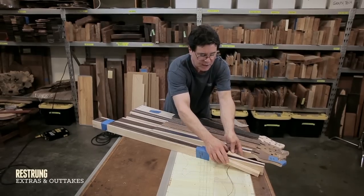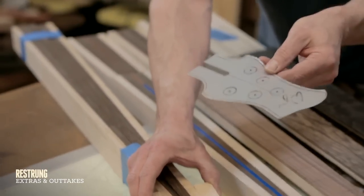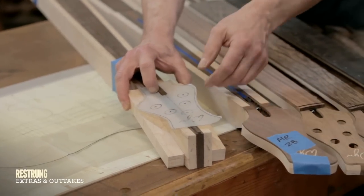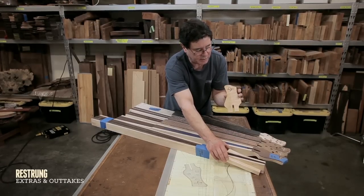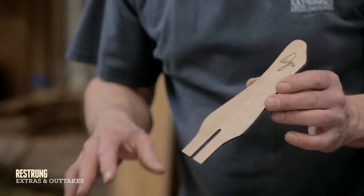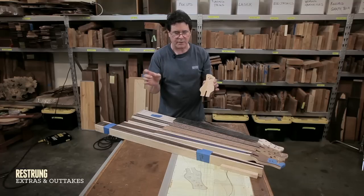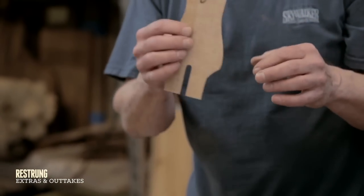I put these wings at an angle because the headstock goes down at an angle. I have a template — this happens to be a five-string — and I know the outer shape and make sure the wings will accommodate that. I'll also know where to drill the holes for the tuning pegs. I also take the body wood and have a thin, about eighth-of-an-inch thick cap made with matching wood for the body top. My friend Heron, who is a laser cutter, cuts in the Wynn logo and cuts out of a contrasting piece of wood like wenge — this is wenge — that goes all the way through. It's like a little puzzle piece that I inlay right into here.